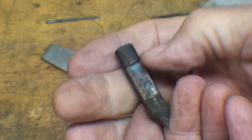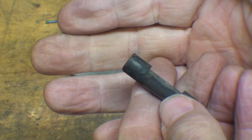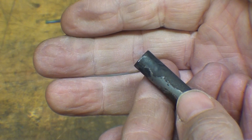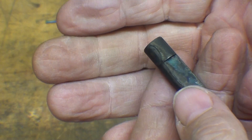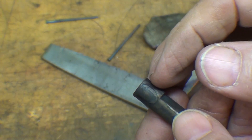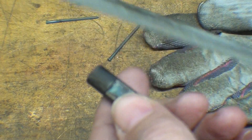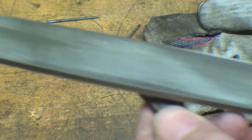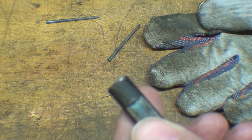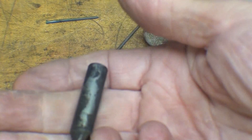But how do we prove that? There are all kinds of methods of checking hardness. The Rockwell scale is the most common. I do not have that — it's a laboratory type of instrument, highly expensive — but it's simply forcing a little diamond into the metal to see how far it will go. But the file test is the most common. I don't know if you can hear the squeaky sound and that the file will not really cut into it.